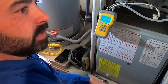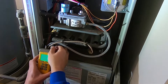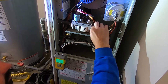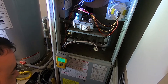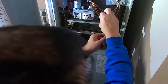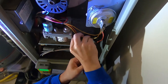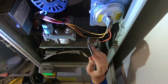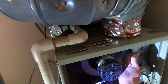But it's not always feasible to do that. Make sure your system is not running before you disconnect this, because otherwise you'll be spitting out raw gas right into your flame. Disconnect your hose, re-install your plug, and reconnect the hose here. Everything's good there.